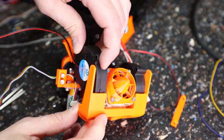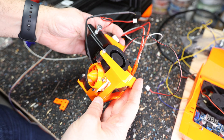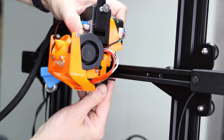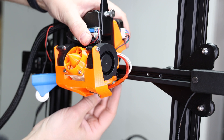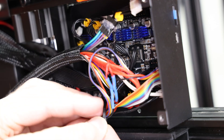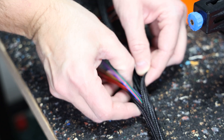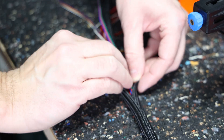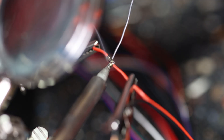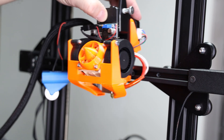I highly recommend using PETG over PLA. You could also print these parts in ABS if you have an enclosed printer, which might be even better long-term. A few of the cables — like the extruder motor cable and fan cables — especially in the direct drive setup, will have to be extended by about 20cm. Otherwise it will be impossible to use the full height of the printer. If you stay on the Bowden setup, this is not a concern.